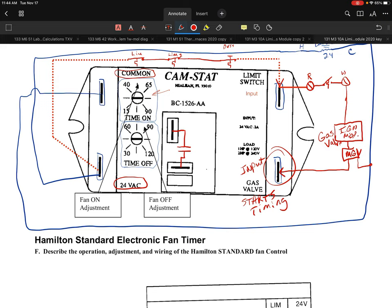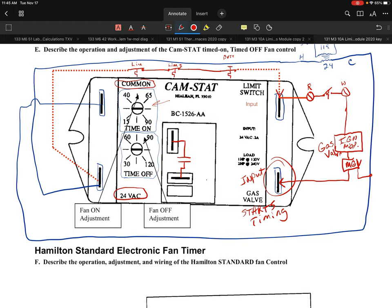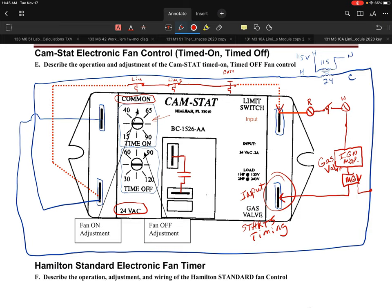A lot of these controllers are set up that way where they'll show you the contacts as being open, but when you test them, they will be closed. It's primarily because they oftentimes will set it up that way where if the system were functioning correctly, it would be considered a normally open circuit. But if there's any failure, then immediately that will end up showing these as a closed circuit as an example. So just so you're aware of that, that could indeed happen. So they might show it that way.